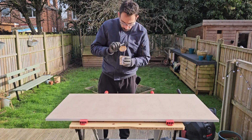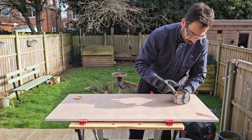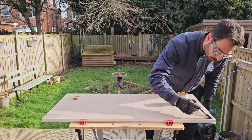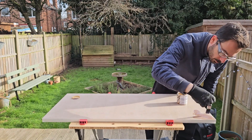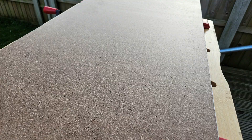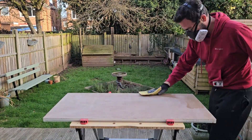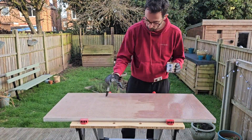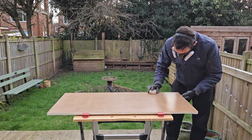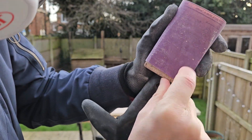Moving on to the next stage: we start using a sealant. The first coat you can consider as an undercoat. Remember to mask your edges and corners — it will help. Keep everything clean and controlled, getting right to the edges. Spreading the MDF sealant — just be careful not to leave any bristles from the brush. A light sand by hand just to prepare it for the next coat, cleaning off any excess dust. Then apply the second coat. Sand by hand again to smooth the surface and prepare it to absorb the next coat, making sure you remove any outstanding debris.